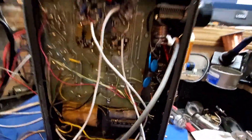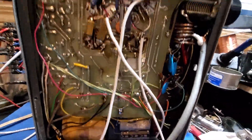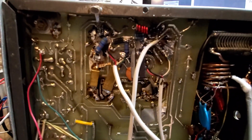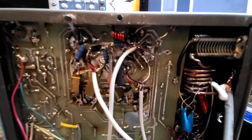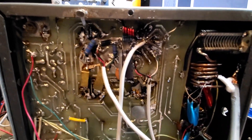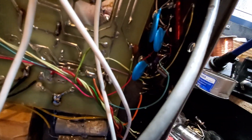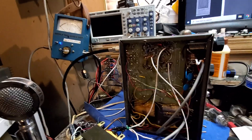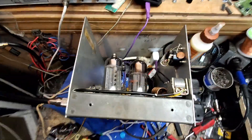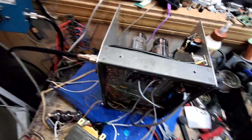This transformer only runs the original Varmint equipment and the final three tubes. We are adding another transformer for another set of high voltage, another set of filament, another set of bias. We've put in all this feedback stuff down here because to get the 6LQ to rock really hard — this is all the work we've done underneath. You'll see bias circuits in there; our feedback comes off of this whole little rail we made down in there, and it is activated by the relay.